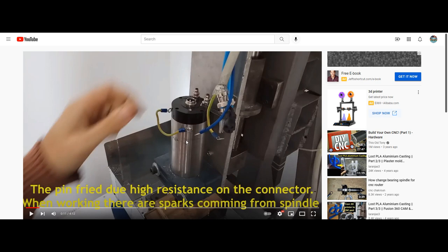How can I test that? Well, if I have a multimeter, I can select it over to the continuity setting, check my probes to make sure that I have continuity, usually by a beep, and then just take the two probes and make contact with the spindle body. If you get a beep, you know that that surface is conductive. You can do that on any surface, including anodized surfaces, to test exactly what I'm saying, because who am I? Screw me. I'm just a guy online.